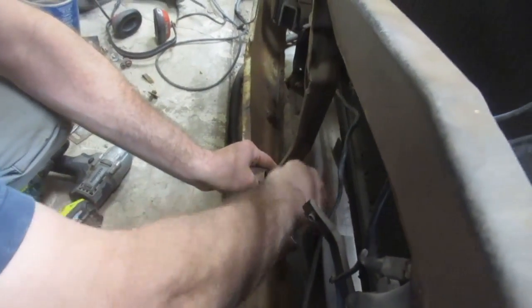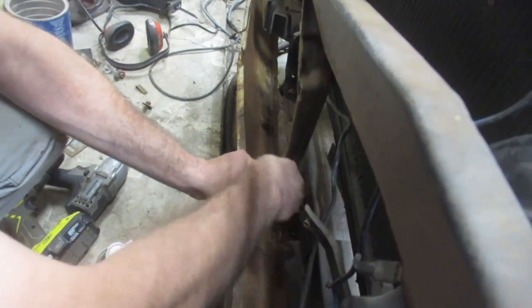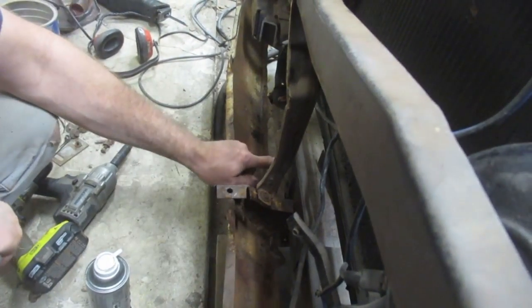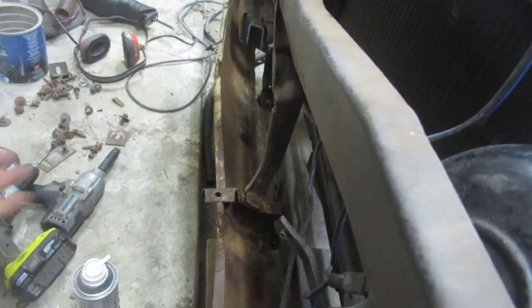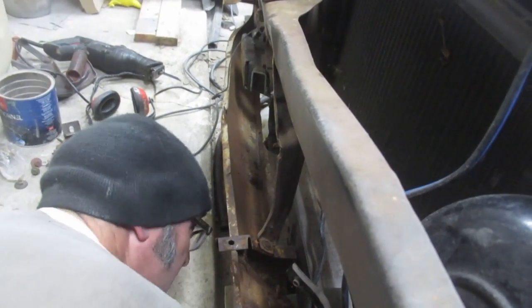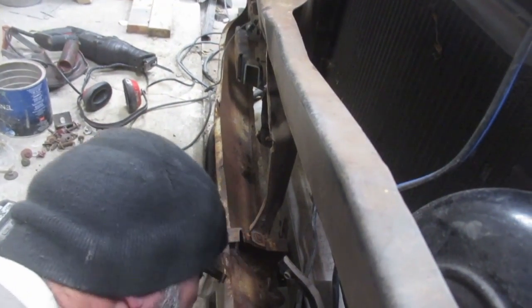Because all the other ones are here. And all these guys, why wouldn't they put those in? That's a different plate, see? That's a separate piece, so they could, and they welded it. We could literally drill that out. If you felt like drilling that out, you're welcome to, if it's less work, but I don't know if it is. How many welds? 1, 2, 3, 4, it'd be 8 welds to drill out. Is it faster to drill out 8 welds?